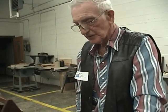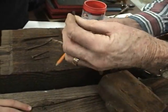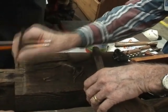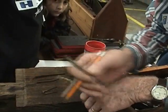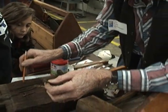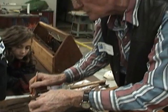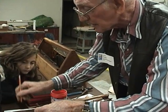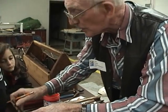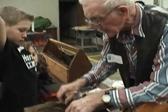I think so. Yeah. See, this is really a poor fastening system, because a square point like that tears the fibers of the wood, and when it tears, it has a chance of splitting. Now in the Rockford School, the outside beams were 8x8 like this beam, and it had pockets cut in here 2 inches by 2 inches, and the outside wall studs were in there, and one of these nails was through it like that in order to hold it. So we salvaged several pounds of those nails when we dismantled that school.